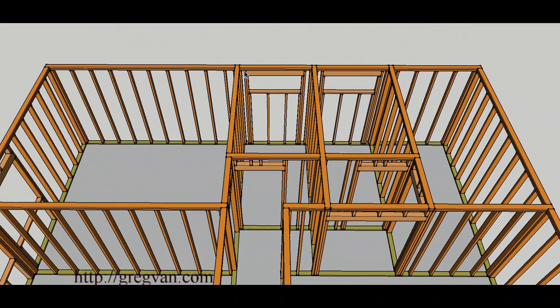If a wall is connected to another wall, it's going to be providing strength all the way through. Some homes are specifically designed with that in mind — they cannot lose that structural connection or the ties that the structural engineer put in, assuming nobody would be removing them. Anyway, that's it for this video. If you have any questions feel free to leave them in the comments. Hit the thumbs up or thumbs down button so I can tell whether these videos are useful.